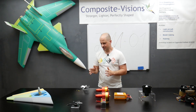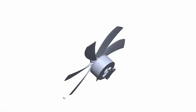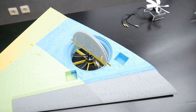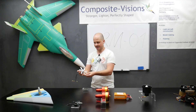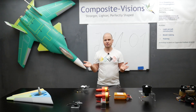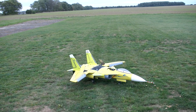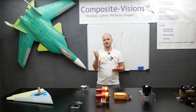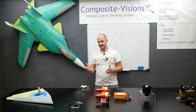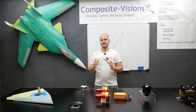These are original motors from X-class quadcopters — very, very big quadcopters, from race copters. These are super efficient and super powerful outrunner motors, and they run on six-blade propellers. On the lift fans they are used for maximum static thrust efficiency. Because on hovering, the airspeed is zero — we are just hovering. So we have to put our electric energy into maximum thrust. That's why we need a big diameter on the propeller and a low RPM. This gives us what we want.